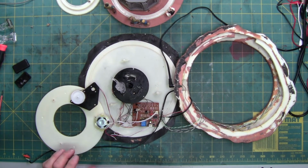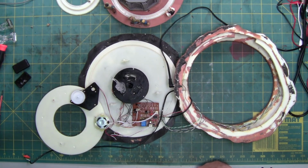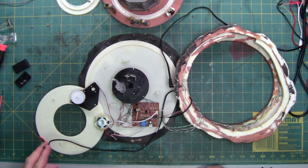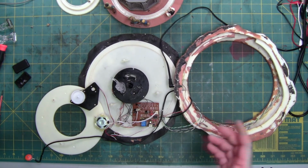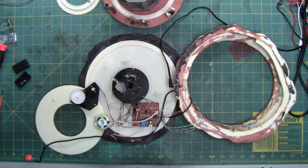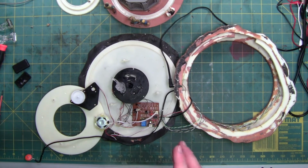But I have to go find my box of spare broken Lemax stuff and see if I can scavenge a switch. Solder the new switch in, test it, and make sure it functions like it's supposed to, so you don't have to wiggle it. We want a good positive on-off click, at which point I reassemble, re-glue, repackage, and ship it back to its new owner. So I shall return as soon as I find a spare part.